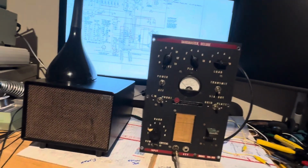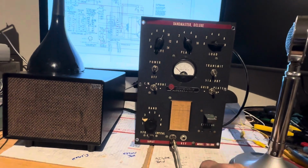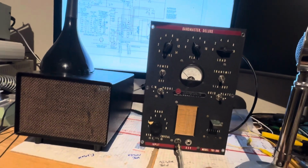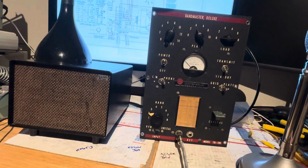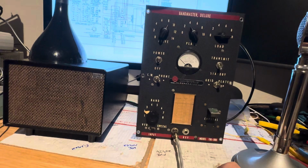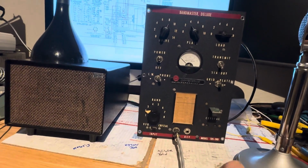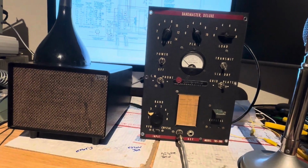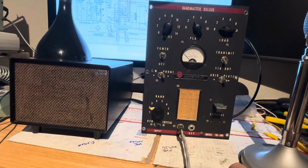Maybe I can use it now for something. I do have a VFO for it, so I'll put a VFO in and dial it up to the local 7293 frequency and see what the guys think. So that's the story on Harvey Welles. I'm a little afraid to run it on 80 meters because last time I did that, it kind of sizzled. I think I'm only safe on 40 meters on it because of the plate current.